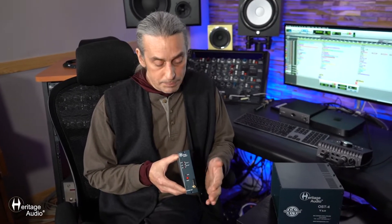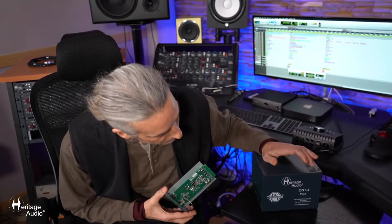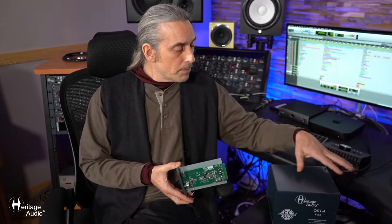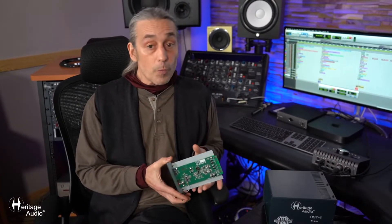For the connections for this unit, they're really quite simple. Entrance is obviously via this antenna, as this is a streaming unit. Slip it into your lunchbox — for example, this OST version 2.0 would be a great option. Then you tap the outputs from the back. Most of these units just have an XLR male and female connection, so included with the purchase we give you a male-to-male XLR adapter that you can slip into the female connection, therefore providing two fully balanced plus 22dB stereo output.